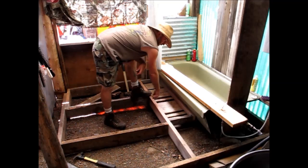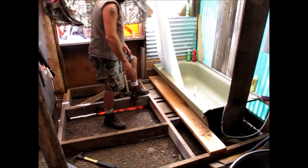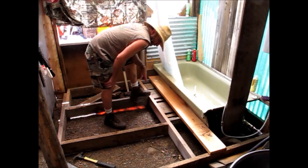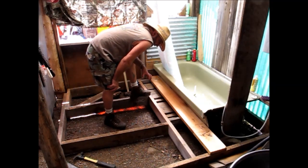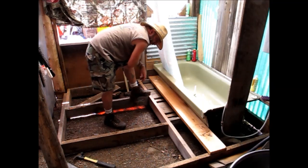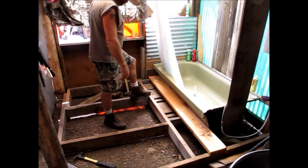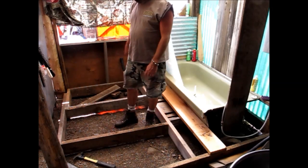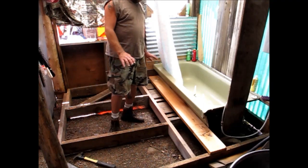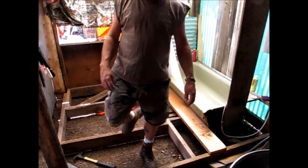Then I'm going to put a couple of filler boards here. I've got the first cedar decking across it. I'm going to leave just barely a little gap. I thought about insulating it and all that, but this is going to be the greenhouse too, so I'm just going to leave it as is. I didn't really want chips — you've got to worry about mold and all that. I'm going to screw the decking down, because over time nails will start to pull and you'll get that squeak. If I screw them down they shouldn't squeak.